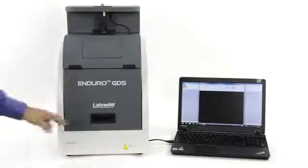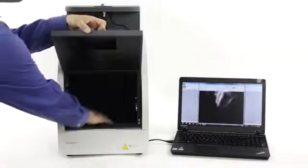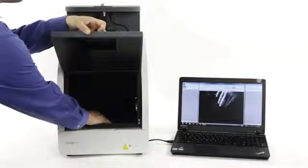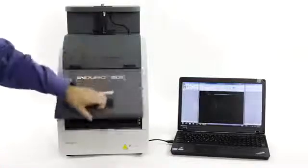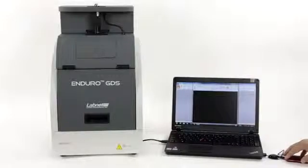To operate, you simply open the cabinet door, lay the sample down on the imager, and view it live on the PC, then position the sample where you wish. You then turn on the UV using the PC. Since turning on the UV is PC controlled, we can also automatically shut off the UV when not in use. You no longer need to worry about leaving UV lights on for an extended period of time, which reduces the life and performance of gel documentation systems.